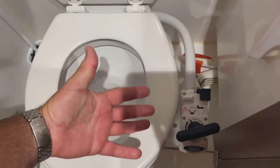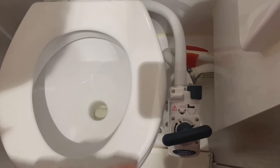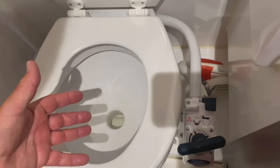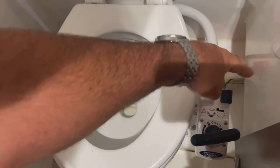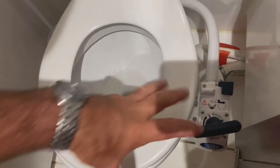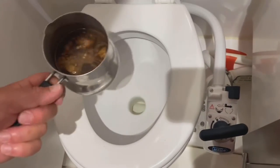The key component parts of the toilet are the pump that pumps up and down. You'll notice these locking symbols here — in all the years I've been using boat toilets, I don't know what they do and it doesn't matter. Over here, this is pretty obvious: that fills with water and that empties — it's a lever. Fill with water and empty. A boat toilet in its natural state does not have water in it. It pumps whatever is in the toilet — waste, etc. — through the pump, through these pipes back here, and eventually out into the ocean or into the holding tank. They need liquid to make it all work, because if there's no liquid, it's like trying to pump a brick through a pipe.